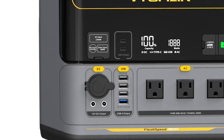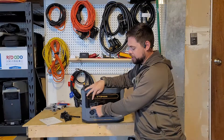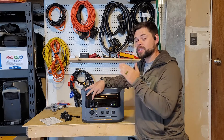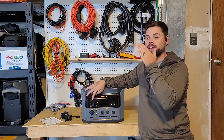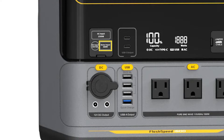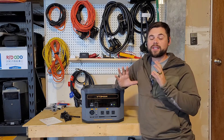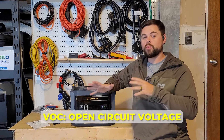Pretty much everything's on the front. We have our AC input, which is a C14 receptacle that the C13 plug goes into. There's a 5521 DC barrel port — this is your car charger port, but you can use solar input on it as well as long as it's below 20 volts. You can connect a 12-volt solar panel, because they operate from about 18 to 20 volts, and it'll give you up to 100 watts additional input. And here is the 30-to-60-volt solar input. The user manual specifically says it's operating voltage, which is your VMP rating, though generally you'd want to use your VOC — open circuit voltage.